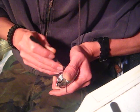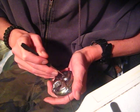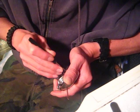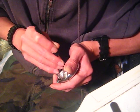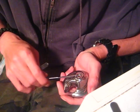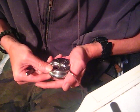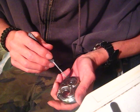Some of these locks will have spool pins — I think this one doesn't, and that stood up that time. I guess it depends on the luck of the draw on what you get, whether they have spool pins or not. Some of them can be really hard to tension — one I had, you really had to bear down on the tension wrench to get any of the pins to bind. I don't know what was up with that. This one I may have gotten rid of, but this one's pretty easy to tension.